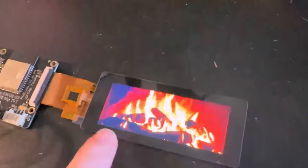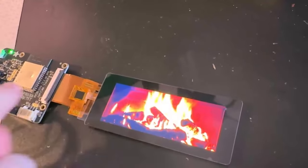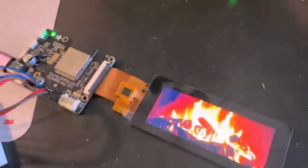They wanted me to add a feature where when you touch it, it goes to the next animation. This is a little flyer animation, but at 10 frames a second you're not seeing as much tearing as we had earlier. There seems to be some sort of built-in hardware support for JPEG decoding — it looks really good. This is going to be a guide soon from Noah and Pedro.